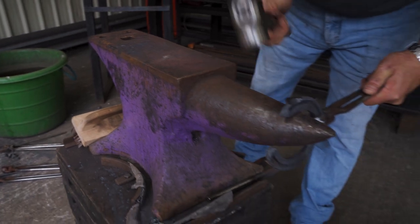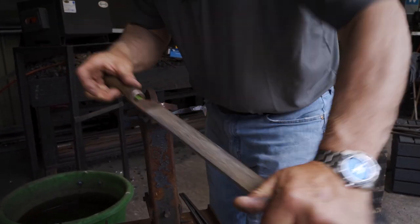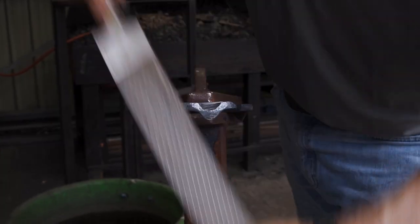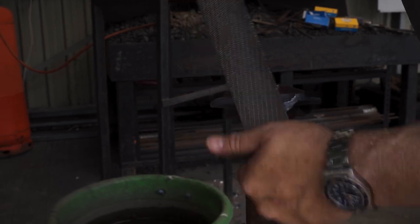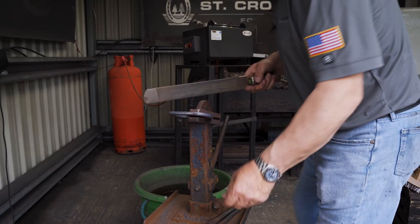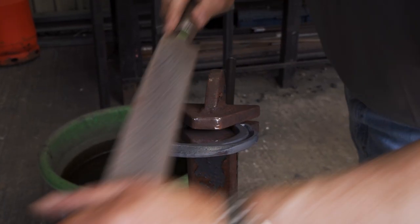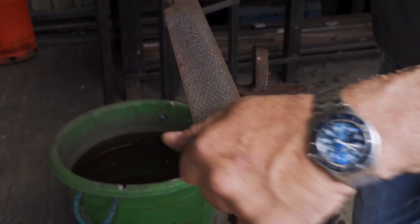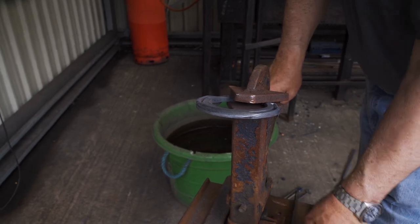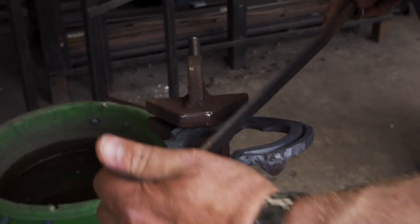Level it. We'll rasp our heel so it's very much a point. Point it right down — now I see it in the picture, and that's my branch. Polish the surface to get a really nice finish on our bar — almost draw filing it. Even with a rasp you can get a really nice finish. You can see the finish coming into it, and that's even with just a rasp, no sandpaper or anything. Turn it so I can get into the middle, draw file it, get a really nice finish.